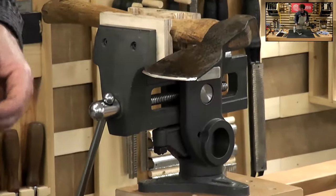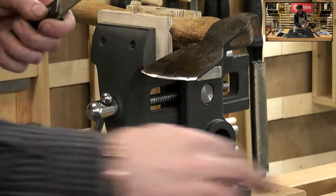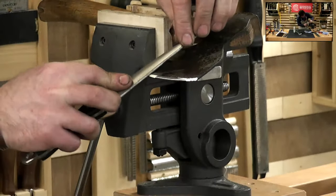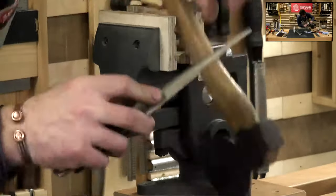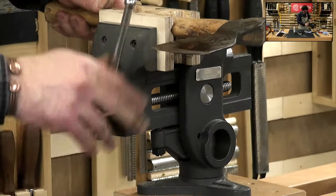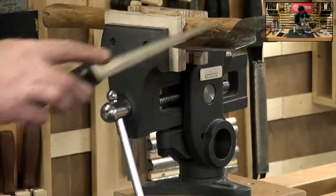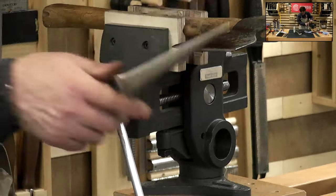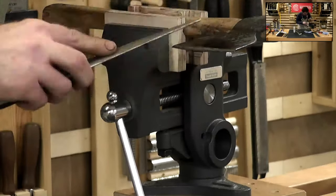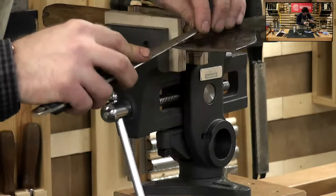So a diamond file, again, you could use, we've got an edge. I've got that diamond file, I just want to clean off that gunk. I can actually push gently around. Let's get it back in the jaws. We're going to lose your angle. You might not see it a little bit, but I've got to go up to there. So you can see we've got a diamond file, we've got the bevel coming down either side. Push around it. You could push upwards if you like, but I prefer coming around that curve, and this has got a little bit of a curve.